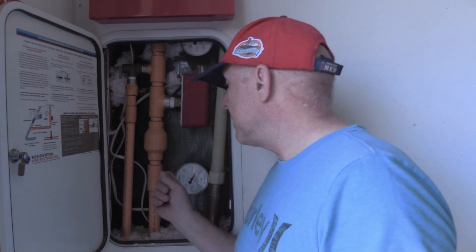We need to test this for two things. One, we need to make sure the pressure is good, and two, that our outside alarm is sounding. In our neighborhood the alarm is only a bell that the neighbors will hear and they need to call the fire department, so it is very critical that that is working.